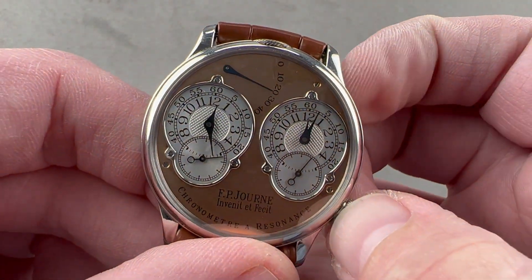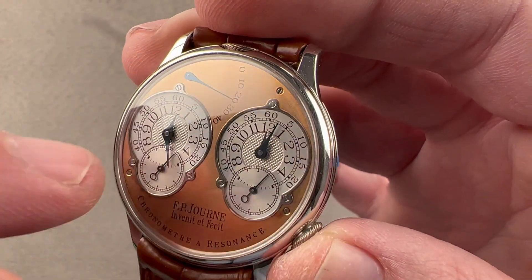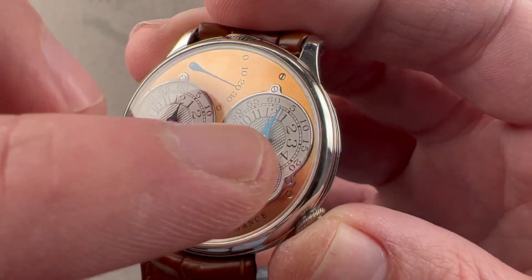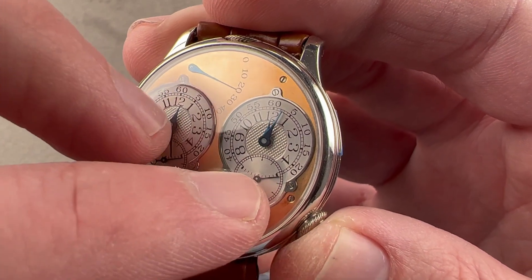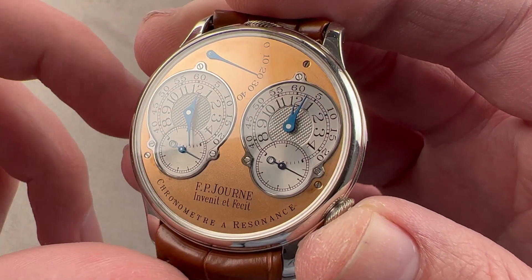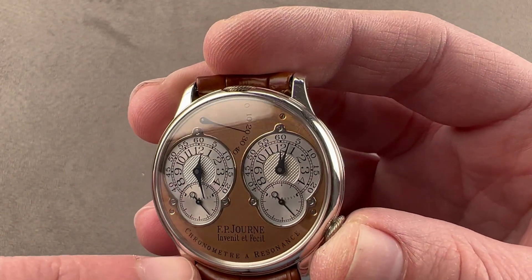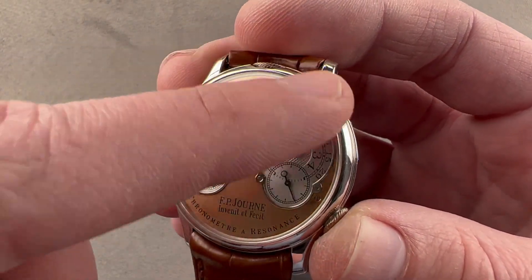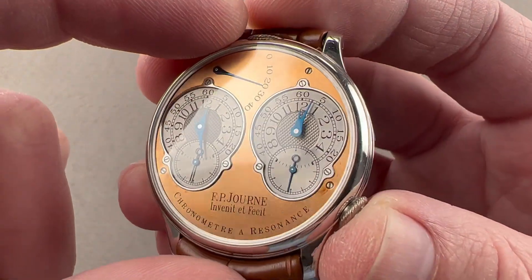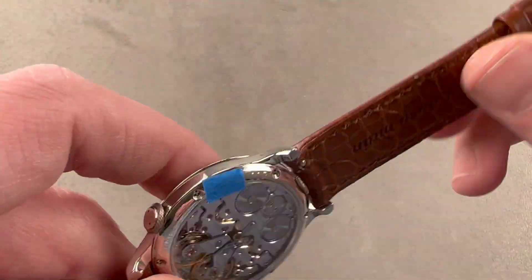For aesthetics, FP Journe gave you a flyback mechanism that synchronizes the hands. The hands are blued and of course hours and minutes are those lovely tapered, biomorphic Journe forms with his distinctive font used radially arrayed. The bezels framing the brass dial centers are made of polished stainless steel, and we have the dial-side bolts that would become a universal FP Journe styling calling card. You can also see that some color gradients develop on these earlier dials — they have a tangible, almost varnished surfacing above the gold base, which gives the impression that the characters printed on the dial are floating, and that too is emblematic of these early Journe watches.